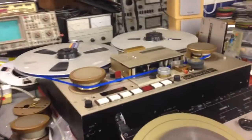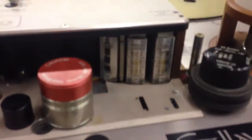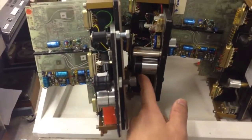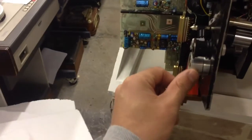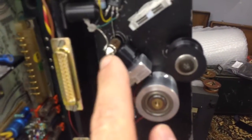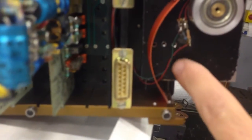These machines come in different varieties. As mentioned, 14-inch reels going through on quarter-inch tape. We have half-inch heads and 35mm heads. Here we can see some more — we've got just a time code head, a 35mm optical reading head, and a 16mm optical reading head. We have a block holding the light sender without the light bulb, going to a roller, and underneath — which you can't really see on this one — is a stereo optic sensor, or in this case probably a mono optic sensor.